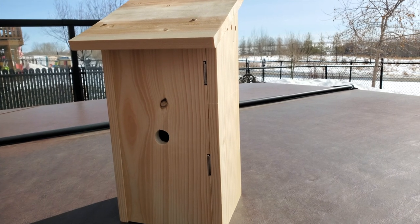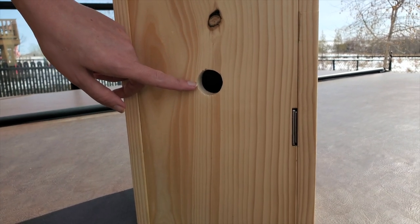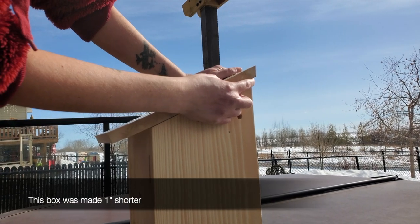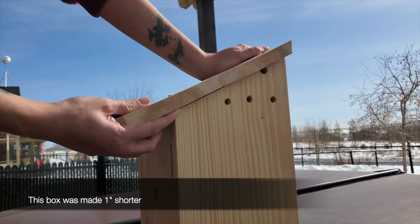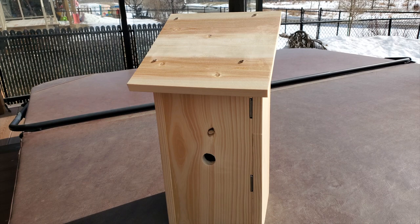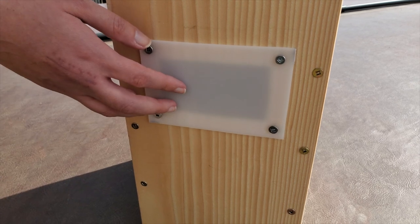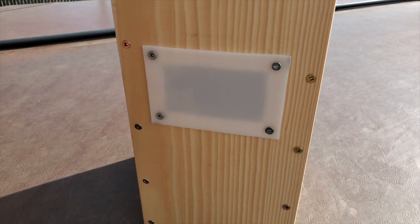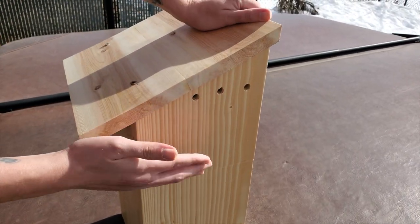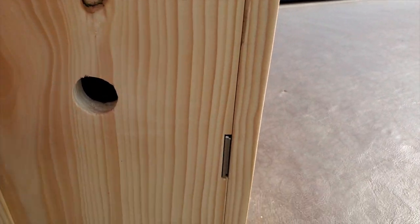This is our completed nest bird box, intended for a chickadee hopefully. This is our one-and-one-eighth inch hole. The total height of the box is 19 inches at the back and about 15 and three-eighths inches on the front — we did a 25-degree pitch on the front. On the side of the box we have our window with a frosted plexiglass to let light into the box so the camera gets a really nice sharp image. We have vent holes on either side on the top. On the front, our doors are kept closed by magnets.